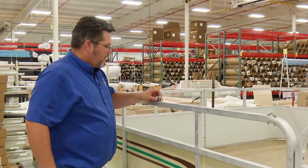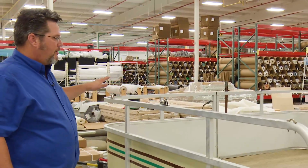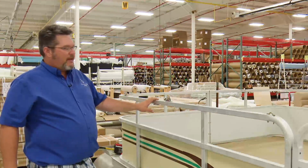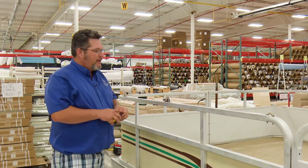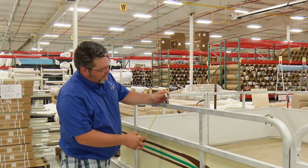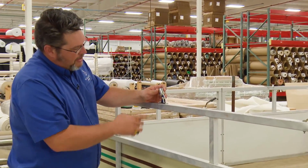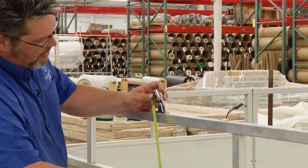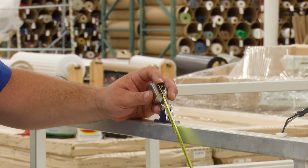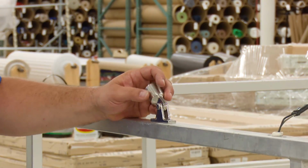Okay. Now, yesterday when we had more assistance, we actually put up the frame, and we've pre-drawn where we want everything to lay out. So we've already put it up and judged where we want to put it. But to show how you would normally do that, we want to realize that we're going to lose some height here with the mounting hardware. The end of your tubing will actually end up right about there. So basically, subtract about an inch if you're using the pivot screw as your marking point.